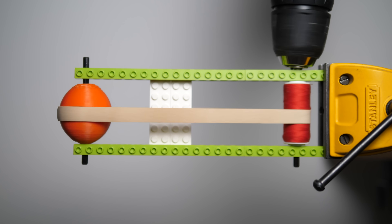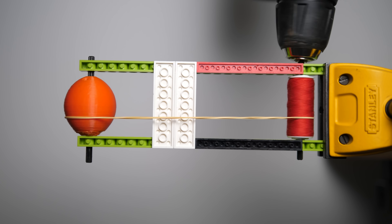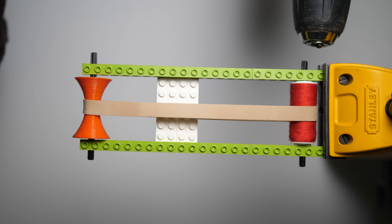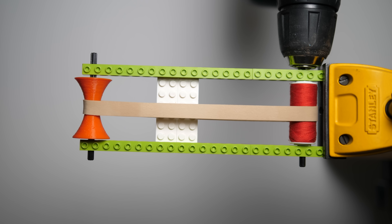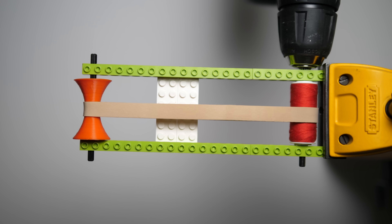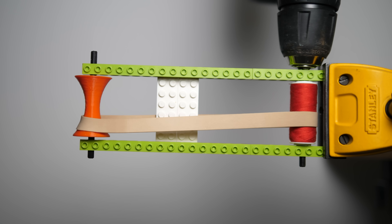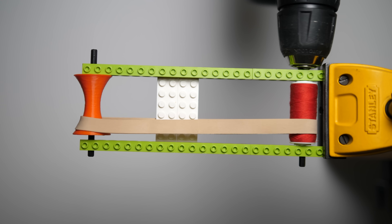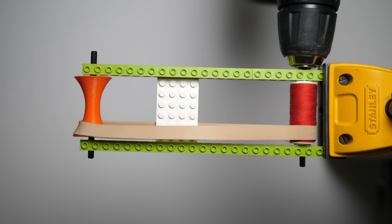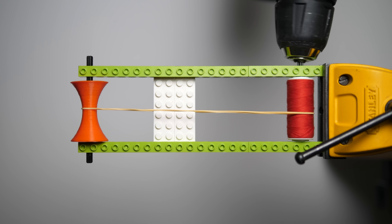Just to prove that it is a belt effect, here's a rubber band that is as wide as it is thick, and you'll notice it does eventually slip off. We should also expect the opposite counterintuitive effect — if the profile has a concave curve, the rubber band should ride up one of the sides when we intuitively expect it to be drawn into the middle. And look, that's exactly what we find. I actually think the bowing effect is easier to see on this one. And just for completeness, here's a thin elastic band in the concave pulley, not doing the thing.